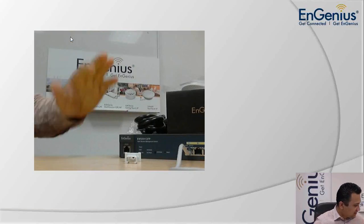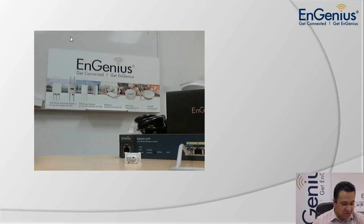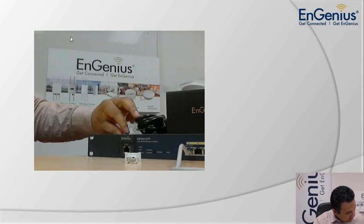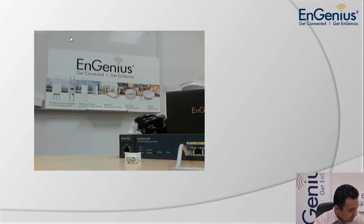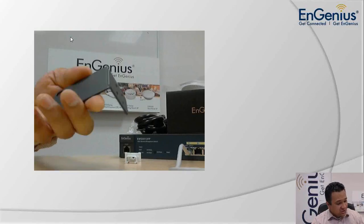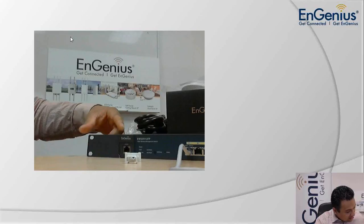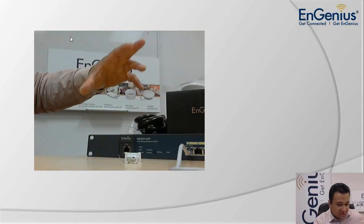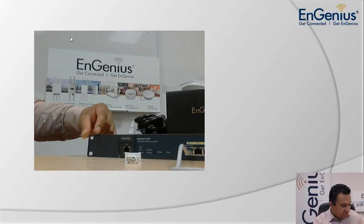So like I said, I have here a switch, and the switches all come with 19-inch brackets to mount them in a 19-inch rack. Depending on the size, this is EWS 5912FP. So the brackets are a little bit wider to fit into the 19-inch rack. The 19-inch switches from the 7 series and up come with smaller brackets to still fit in the same 19-inch distance.